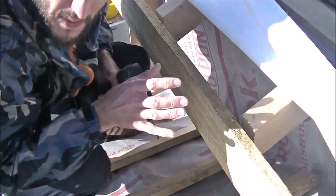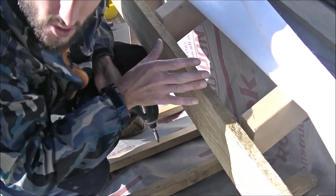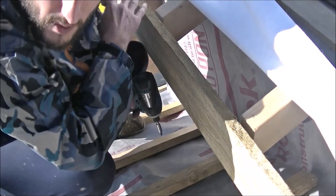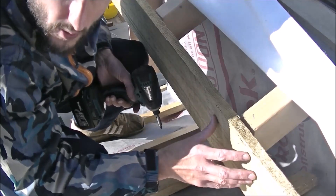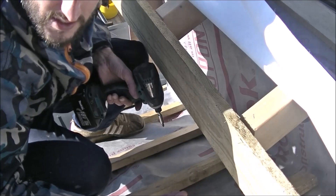Unfortunately this is the best angle I can get to see me doing the cheeks of the dormer. I'm just going to put some vertical bands on here so that we can count them out in the cheeks of the dormer like we did over the side dormer. Now I can do a bit of lead round here and then we can begin to tile up the side whilst placing in our lead soakers. First I'm just going to take off this piece of fascia, which is temporarily fixed to the side with one screw, to get access inside.